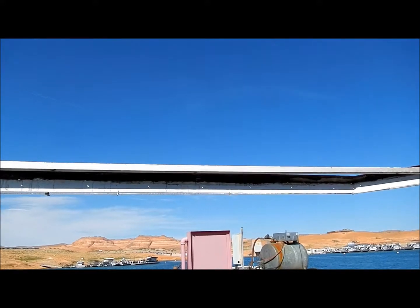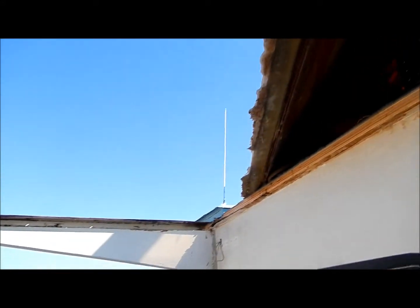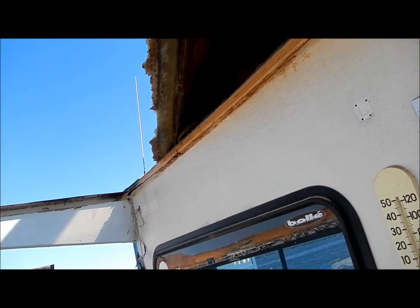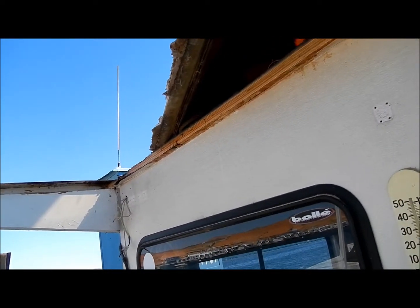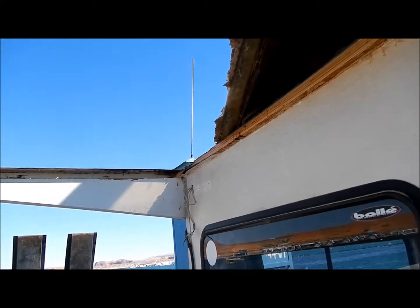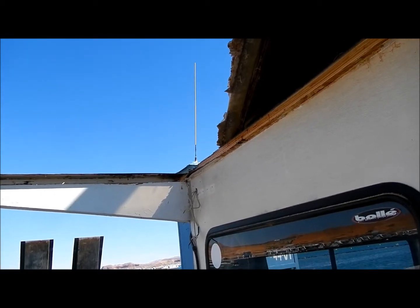That means we don't need to get any special sized material. The problem, unfortunately, is this dimension right here from side to side is over 12 feet. It's 12 feet 3.5 inches, and so that's not good. But maybe you could live with a shorter, like a 12-foot 2x6, and just not fasten on the ends. That'd work. You know what? I take it back. That'd be fine. The problem is it's still over 12 feet. So when you're talking about the plywood, you're going to have to do something fun there. But anyway, I think that's it.